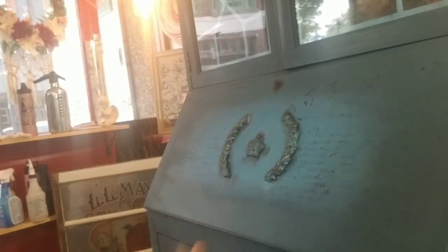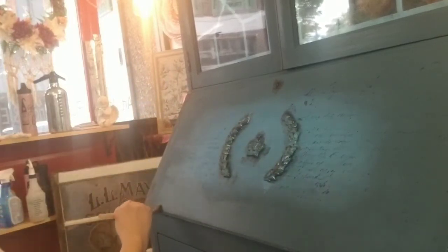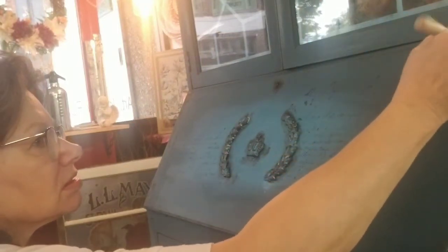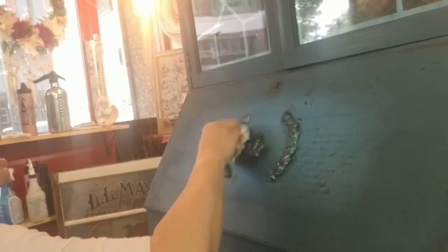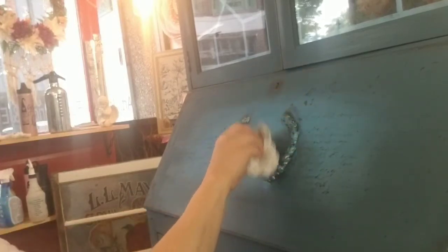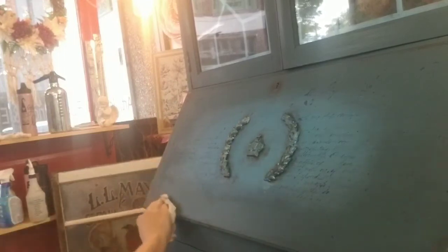I do the molding and wipe that back a little bit, and also around the edges where there's molding detail. I love to get the corners — anywhere where it would naturally age or gather dirt. Do you like to distress your pieces? I hope you're being adventurous. You can use glaze or you can use wax, and I'm more of a fan of the wax. I feel like it's like moisturizer for furniture. The glaze is a little harder to manage, but it's all a matter of preference.